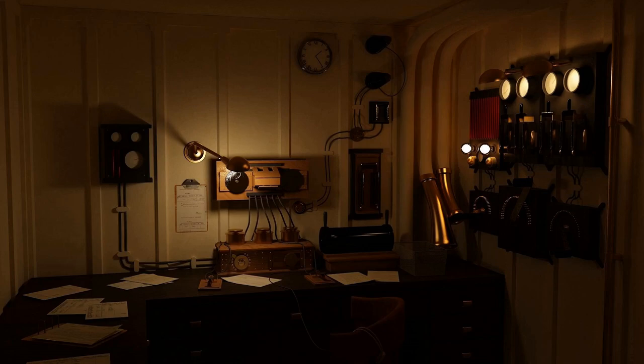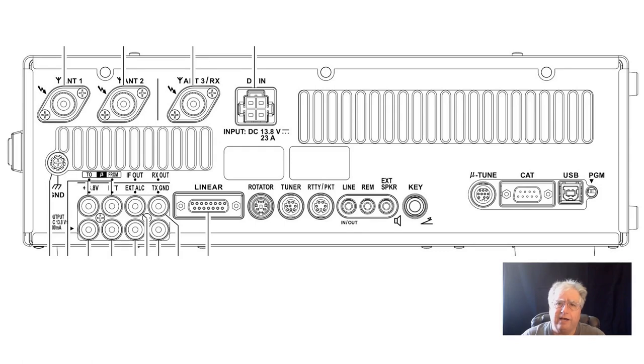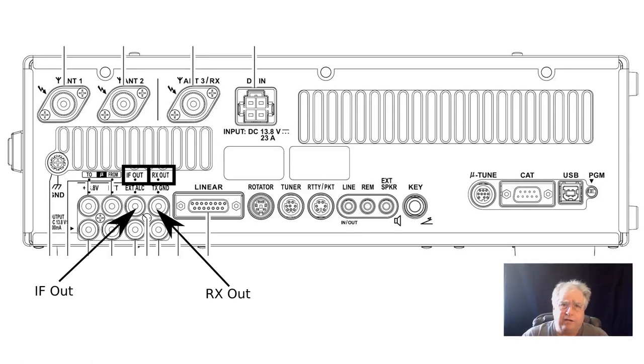So what are we going to do? Well, I've got a few solutions. Let's take a look at the easy way — and actually it is the safest way too. If you're fortunate enough to have an RX or IF output out of the back of your radio, or if you've done a mod to pull IF out of the back of the radio, then you're kind of done here. Everything will be done for you. When you key the radio to transmit, you're going to have the antenna disconnected from the SDR. You're not really going to have to worry about that. Also, when you key it to transmit, you're not going to have to worry about it not being connected to an antenna because you're still on the SDR portion of the antenna switch. So if you have those outputs, it's the way to go. Now you can use either the IF or the RX output — there are advantages to both.